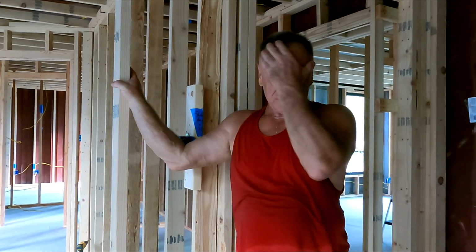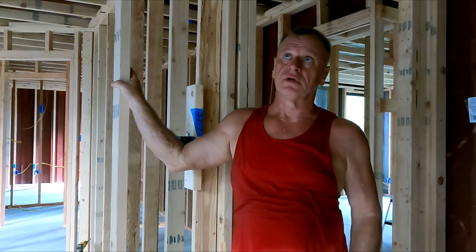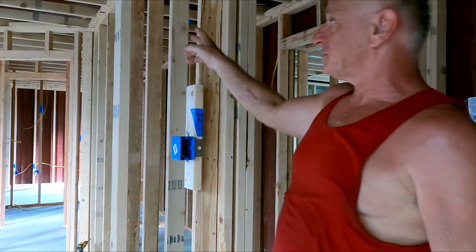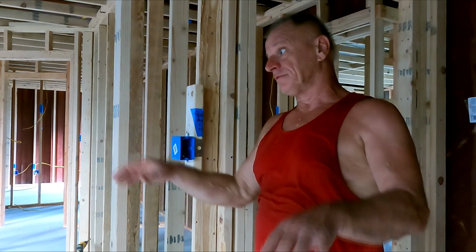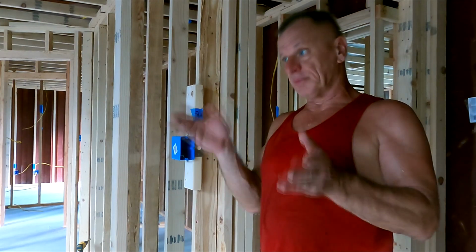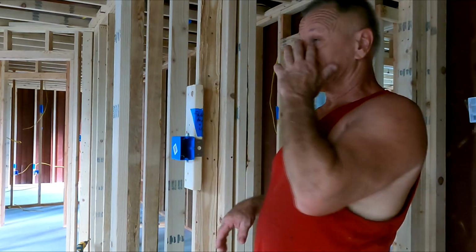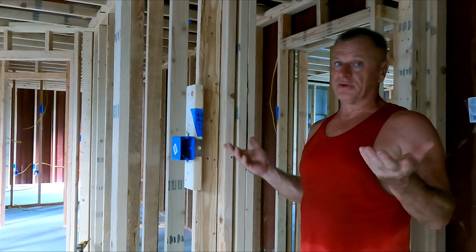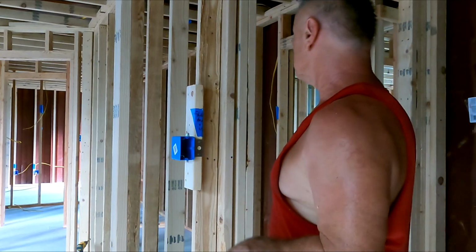But Pop came over to help. You saw him helping me do the sockets. I just did the wires, the power runs for the lights. The lights are on the same circuit. The sockets are on a different circuit. My office, Angie's office, and the bedroom are on separate socket circuits, so I'm trying to keep that separated. Lights, however, in this whole area are on one circuit because they're kind of a low amp issue.